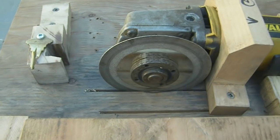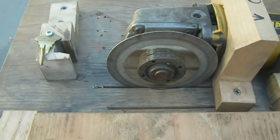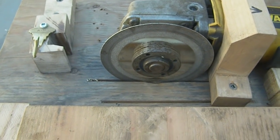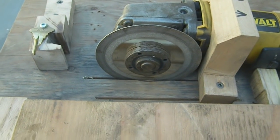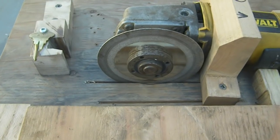The key is that they're diamond — diamond is what grinds carbide. And speaking of grinding carbide, carbide contains cobalt. You want to protect yourself from the cobalt dust.